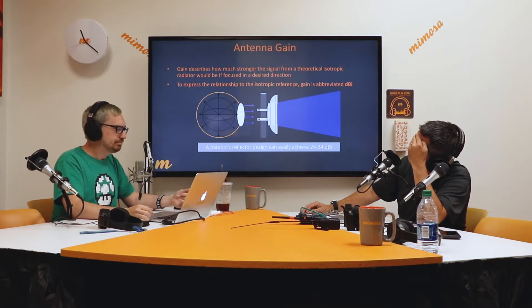The first thing is the antenna that you have. It could be that you have too low of an antenna gain for the link distance. It might have a really bad front-to-side ratio, so you're picking up a lot of noise from other co-located antennas. Also consider the operating bandwidth of the antenna — what is it designed for frequency-wise? A common thing we see is people using a Ubiquiti dish that only works between 5.1 and 5.9 GHz, but they're using 4.9 GHz or 6.4 GHz and wondering why signal is so bad.